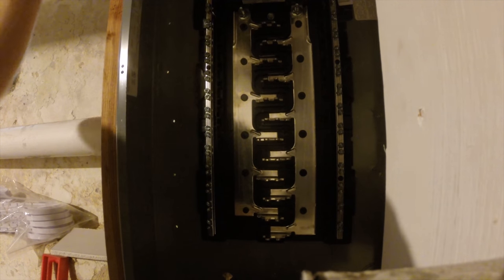So that means the next step, these wires that are coiled here at my feet, we're gonna take from where they come out of the ceiling down here. We're going to drill holes through every single one of the floor joists. Basically make a path that goes all the way down, and then we'll tie those into the new box. Once that's done, we can at some point down the power in the house and do the panel swap. That'll probably be a bit of an adventure, and I'll have to do it during the day because I won't have any light because there won't be any power.